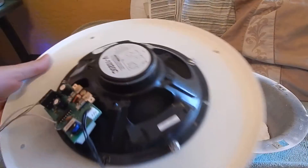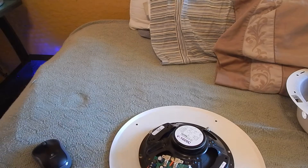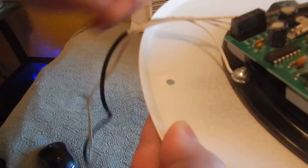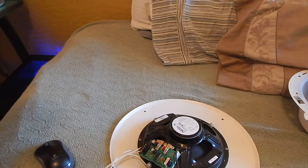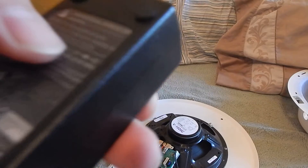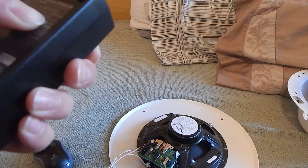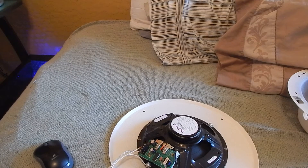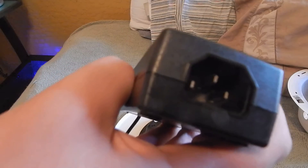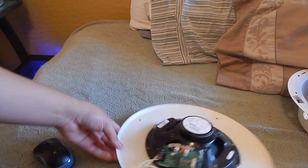As you can see, here's your board right here. Valcom speakers require a 24 volt adapter, but I didn't want to get that adapter so I use this 12 volt AC adapter right here. You want to look for your output type — this is 12 volts, a 3.33 amp adapter, not milliamps, so it'll work fine. The 24 volts and 12 volts are real common to each other, and it has this standard IEC plug you can find on a computer. Then you would hook your adapter up.